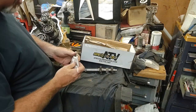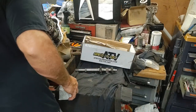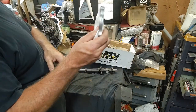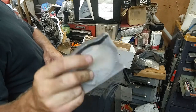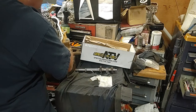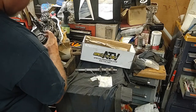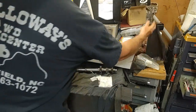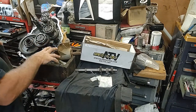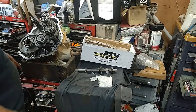I'm not going to unwrap this all the way because there are some bolts in there I don't want to lose. This thing's probably about an eighth of an inch thick from the factory, and the replacement looks like close to a quarter of an inch thick or maybe a little more. What that does is - this thing has a ton of pressure on it, especially through this snorkel gear - it will actually allow the shaft to move out and you lose your clearance on your gears, which can cause a lot of problems. So this helps hold it down and keeps that little bit of deflection from causing damage.